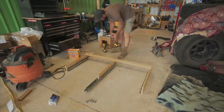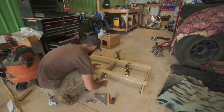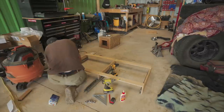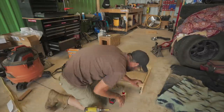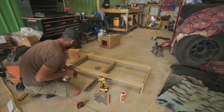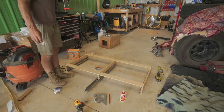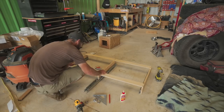With the slides now mounted, I'm going to assemble the front half. Like I said, I'm going to be using slats across the top, so I'm just screwing the slats onto the side boards and center board. The slats themselves I actually made out of some half-inch plywood that I cut down to the sizes I wanted.